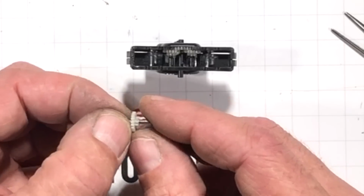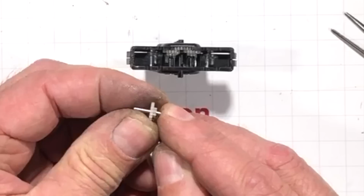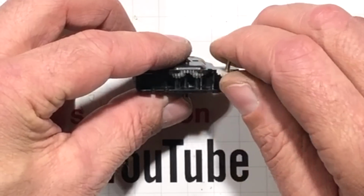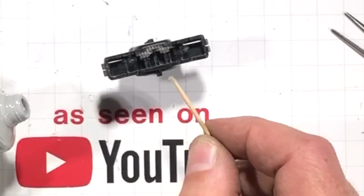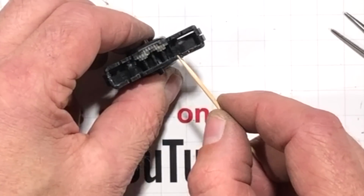Now these little guys, another way you can tell that they're cracked is because the axle that it's sitting on moves back and forth. So when these go in, of course, you got to get them timed up to ride where they're supposed to ride at. Now, of course, this metal axle, if this gear was tight on it, it would spin. So we also want to put a little bit in all these little grooves here for these axles.